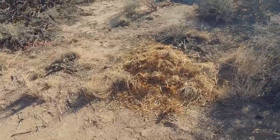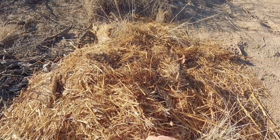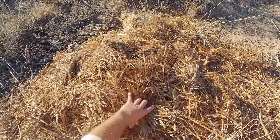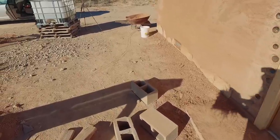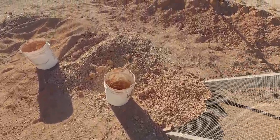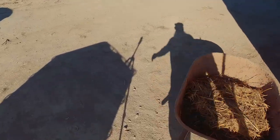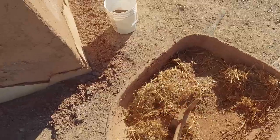The other element of structural earth is fiber. People have used many things for fiber throughout history — wool, straw, manure. The manure of grass-fed animals contains a lot of good fiber. I've got some old straw that's really not suitable for construction anymore, but I'm just using it to help hold the mix together, help it grab onto the nails around the plate and the screws around the cinder blocks. I like to mix in the wheelbarrow where you can easily lift all the dry material while it's still dry and then transfer it right to where you need it. I also like to mix my dry materials together before adding water if possible.